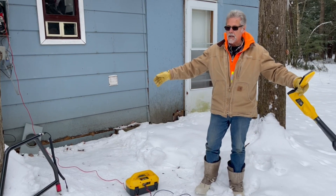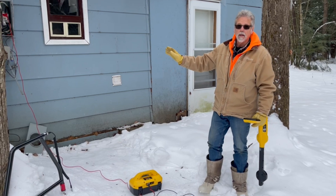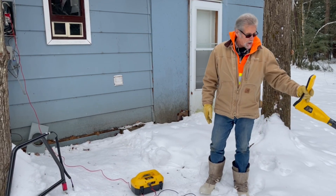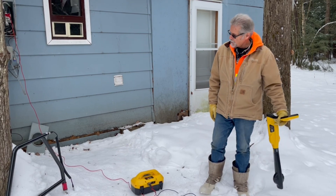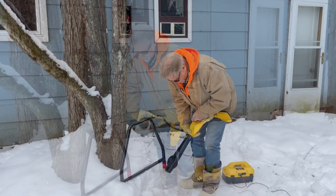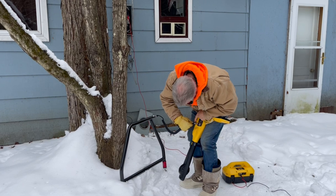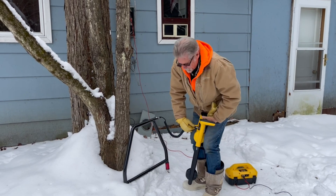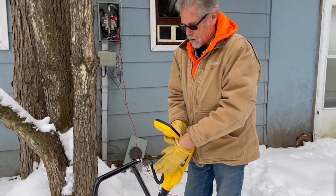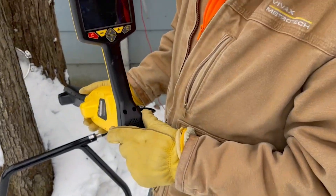So you always separate the two of them in almost any direction — it doesn't matter. This line happens to go under this building off in that direction, but we put the ground stake out there. Fortunately the ground is still not frozen, so we're able to get the ground stake in okay. We're in fault locate mode and we've already done a locate. Plug the A-frame into the receiver — as soon as you plug it in, the receiver automatically goes into fault locate mode, moving from being a locator to a fault locator.